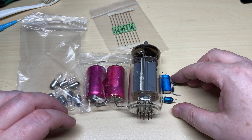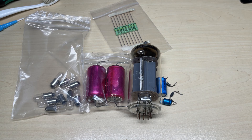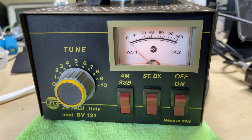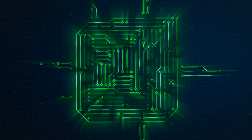These are the parts we've changed: a couple of capacitors, diodes, the big capacitors, the bulb, and some bleed resistors fitted. The BV131 is finished and will be a nice addition to my shack, with it being a tuned unit it should produce a nice clean RF. Stay safe — don't put your fingers in these if you don't know what you're doing. Thanks for watching. Don't forget to like, subscribe, join the Facebook group, buy me a coffee, and we'll see you in the next episode.